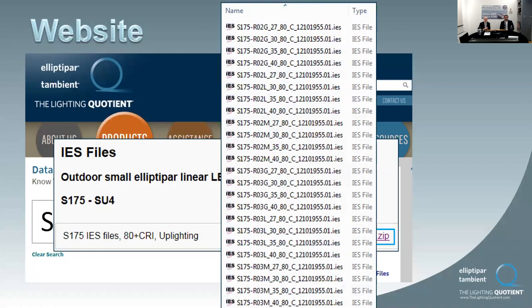The three drive currents we're offering as standard, and then each of the 4 color temperatures. So all this information has already been factored. If you have a designer who needs 27K in the medium 350 drive current, there's no need to open one file, go to that scaled performance table, and figure out what the multiplier should be. All that work's been done in Photometric Toolbox.